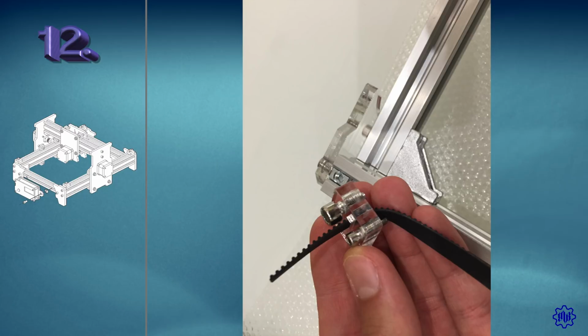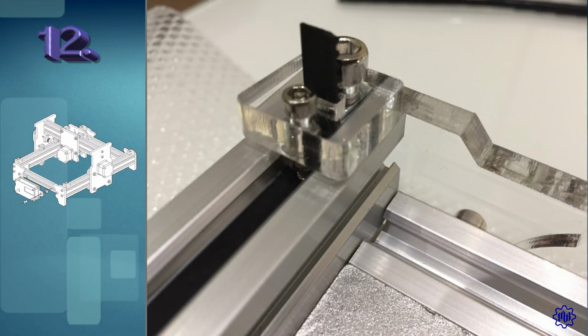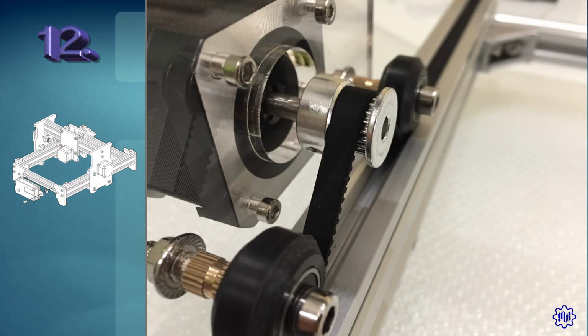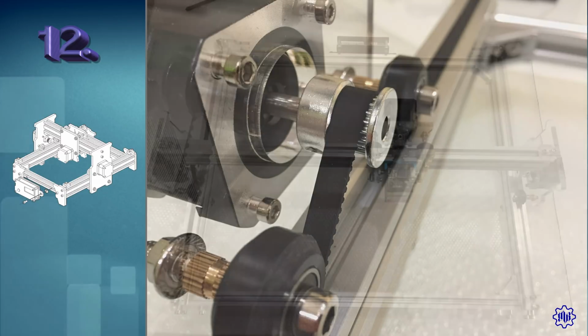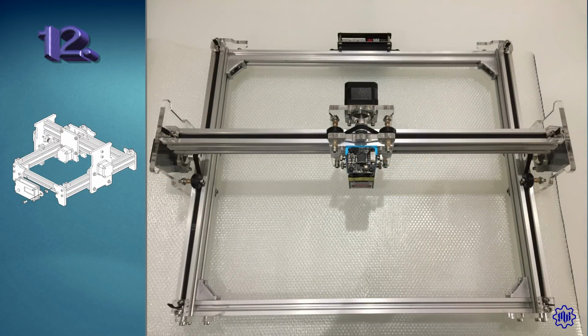Once the 3 pieces have been cut, insert one of the ends in one corner, stopping the strap with the square plexiglass. Let us pass the strap under the first wheel, then over the toothed pulley, to finish again under the second wheel. Let's fix it to the opposite end. The first strap is positioned. We do the same work for the remaining 2 straps.